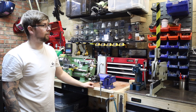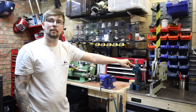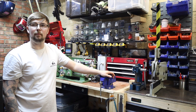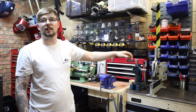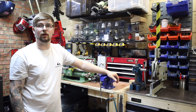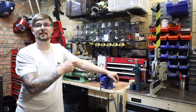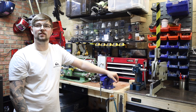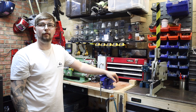Moving back up top, this is where our metal guillotine and little arbor press live. Neither of these two get massive use, but when they're needed they're up here ready to go. The metal guillotine I actually managed to save from work — it had quite a few worn-out pieces and I had to machine a few new parts on it — but it's all operational now. When I need it, it's really handy. It can quite easily cut about two millimeters of thick sheet metal, so it saves getting the grinder or jigsaw out.